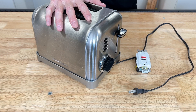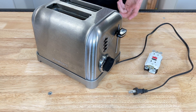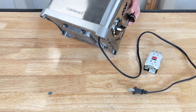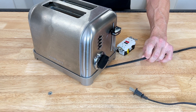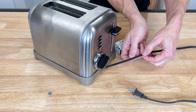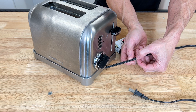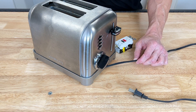To give you an example of how a GFCI protects you from a faulty device: if the wiring inside a toaster — like the wiring going inside — or if the cord itself gets frayed or damaged and has a bare hot wire touching the toaster frame, or if there are two separate wires inside and the insulation wears out and those wires touch each other, or if only one of those wires touches the frame, that can cause a ground fault.